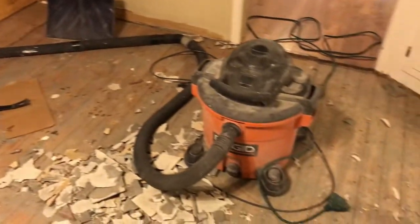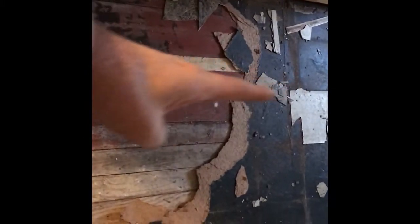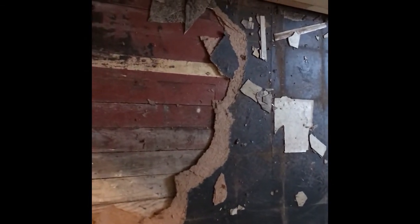Let's look in the laundry room. Walking into the laundry slash utility room, you can see the floorboards go this direction and the floor joists go perpendicular. That means I can literally cut right up to the walls on these two sides without undermining these interior walls. So I'm going to remove all this tongue-and-groove pine and at that point address all the issues with the floor joists we diagnosed yesterday.